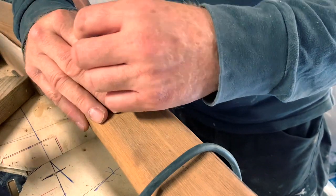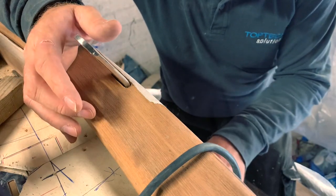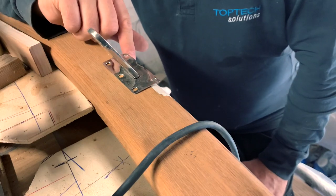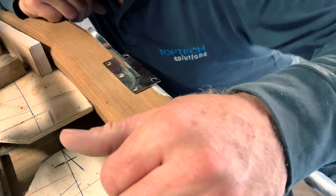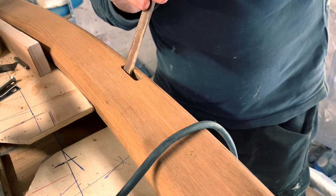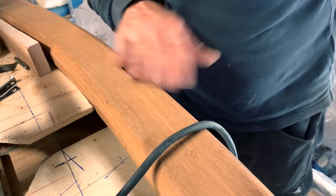So now I use a bolt to leave it in position and I would like to check the metal plate that covers the chain plate. And as you can see, it doesn't fit well the new capping rail. I need to go to Andrea's factory and make a brand new one. But before that, I need to make a very nice and smooth hole, because I don't want the chain plate to make some strange force on the teak and risk breaking my capping rail.